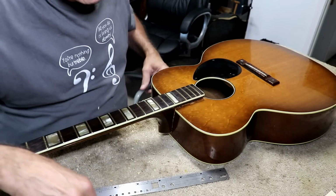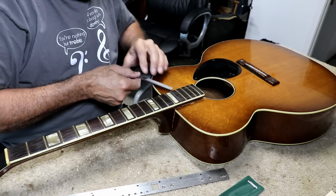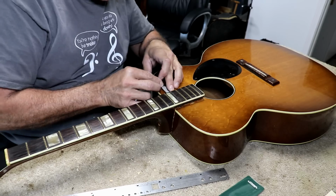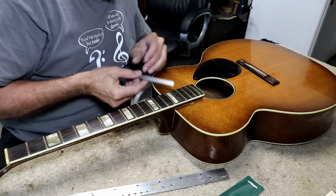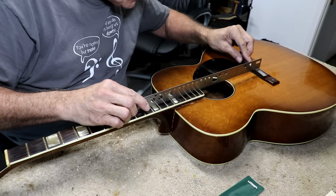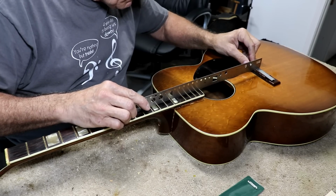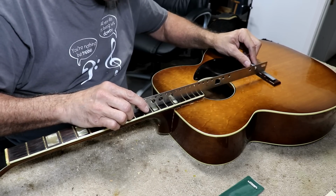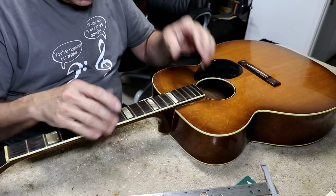And you know, I haven't measured it, so let's try to measure it. Maybe we can measure it with my wedge here. Yeah, we're pretty high. It's 150 thousandths plus. It's more than the gauge can measure. So let's go here and see if it's more than the gauge can measure here too. No, we're touching here already, but not much. We're touching it at about 140 or 150 roughly. I mean, right in that area. So if anything, we want it to tilt just a little bit more.